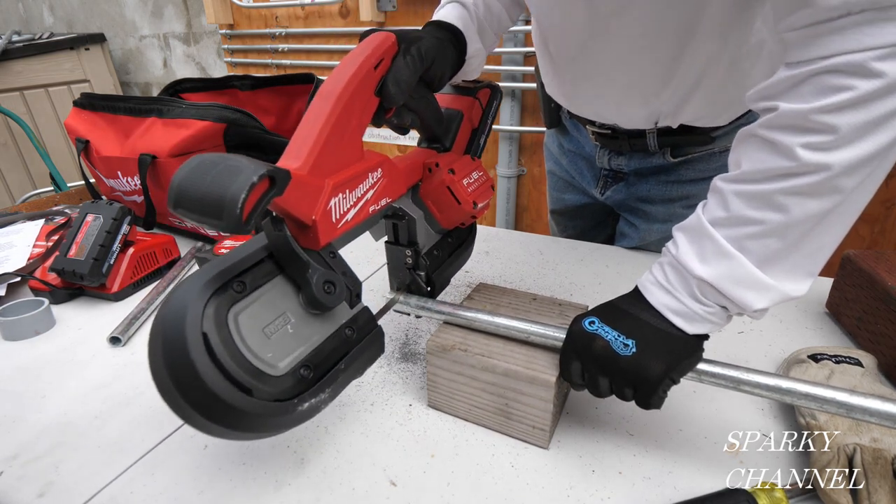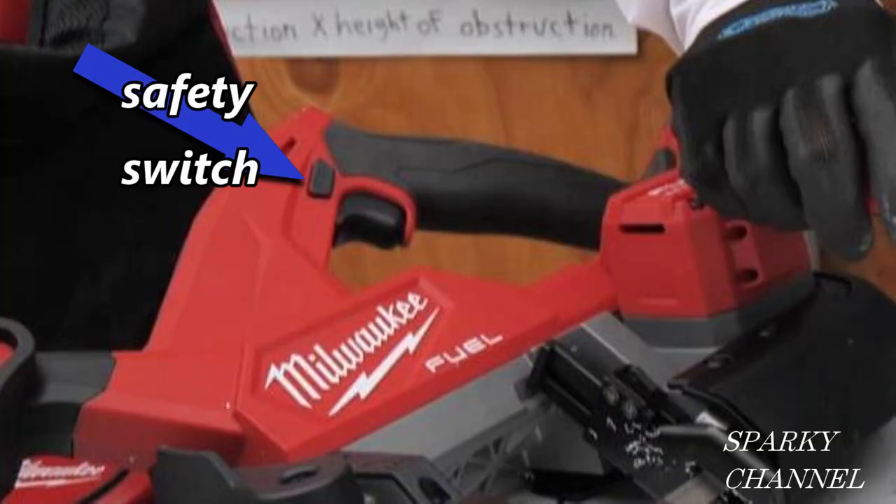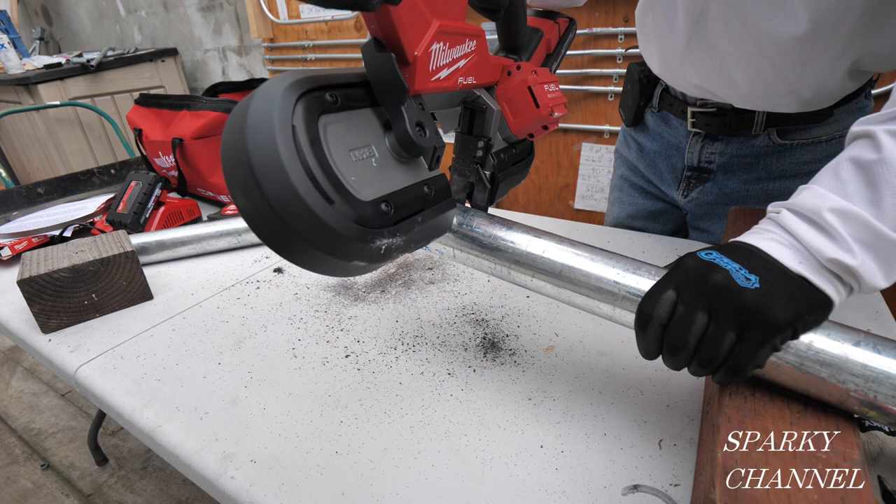In conclusion, I really like this saw — it's lightweight, feels good in my hand, and it's quick to use. If I were to make a couple of suggestions to Milwaukee: I'd like the safety switch to be a little closer to the main switch — it's not a deal killer, but it would be more convenient. The other thing is I think it'd be better to include a 12 to 14 TPI blade with the saw instead of the 8 to 10 TPI, as that's more of a multi-purpose blade. One thing I really like is that it's brushless.